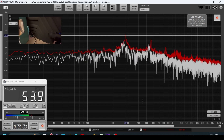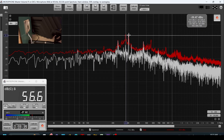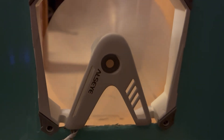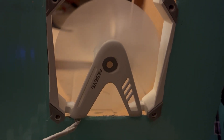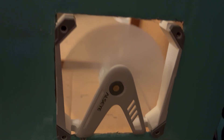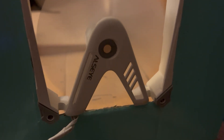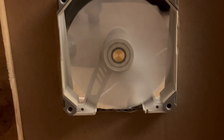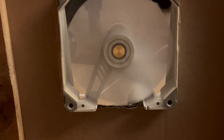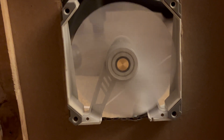At 100%, 70%, and now at 20% PWM, I want you to try to hear the sound. Moving the microphone close, you'll hear a sort of rattle hissing. That comes from the blade itself not being particularly well centered. You can see the center ring just kind of bouncing there, and that piece in the middle — the sticker — is actually pretty well centered, so that's just the hub vibrating around.